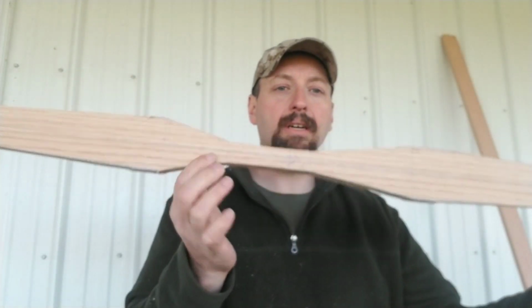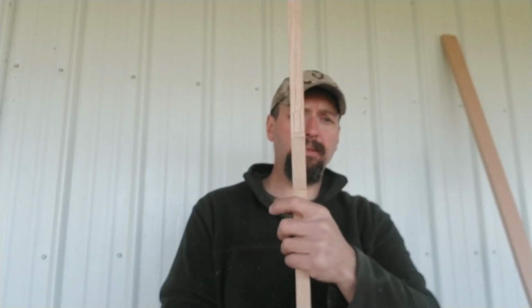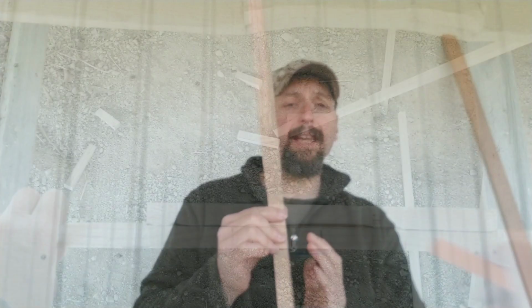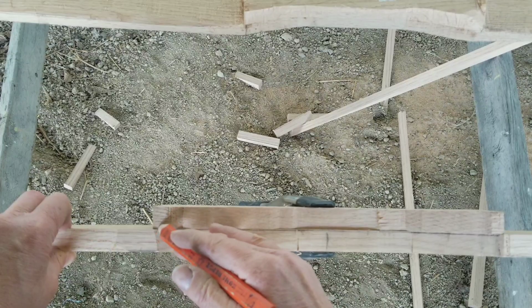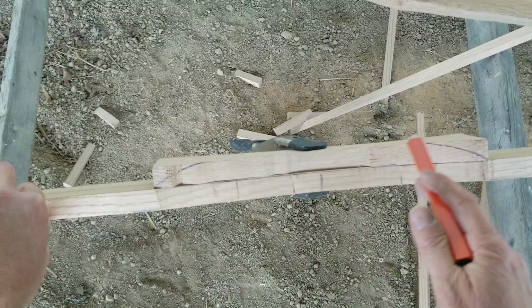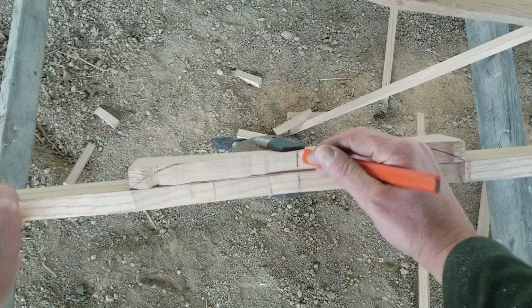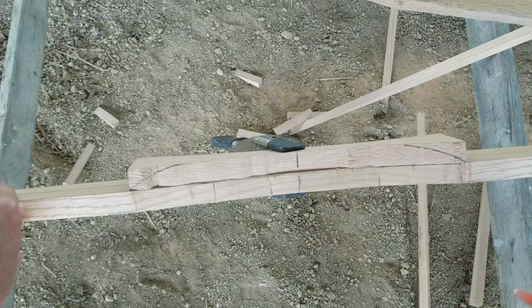All right, so right now I've got this all cut out, and it kind of looks like a pyramid bow stave. Issue is it's only 3/4 of an inch wide. So at this point, we're going to go ahead and laminate in an area for the handle. Here's the bow on its side here, and what we want to do is just give ourselves a decent radius to take this off. So you could literally use anything to get this radius. I use a 5-gallon bucket. I think it looks better when it's a little bit bigger. I'm going to go ahead and carry that center line over just so I see where I'm going to line this up. And I'm going to go ahead and hit this with a sander, and it's going to take me like a minute or two compared to using a chisel and trying to do it the hard way.